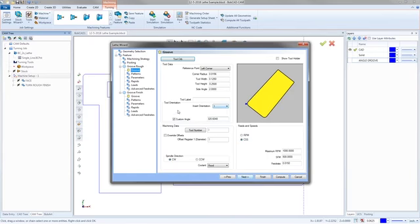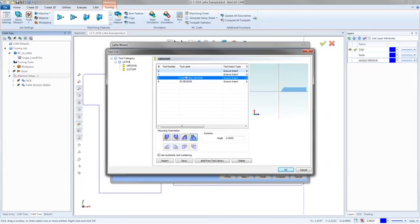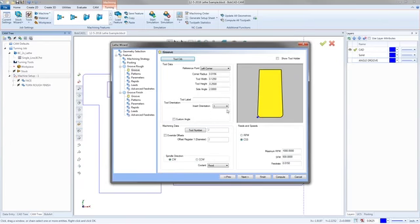All right, on to the groove. So right now it's trying to pick this custom angled tool. Let me go in here and see if we have a better grooving tool. So right there, number 2, that's the one I'm going to pick. So I'll click that and hit OK. For whatever reason, it grabbed the angled groove tool, but that's the tool I want right there. So other than that, pretty standard. The rest of the settings are the same.